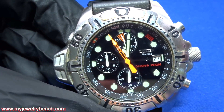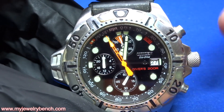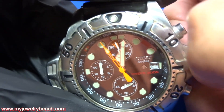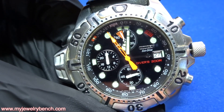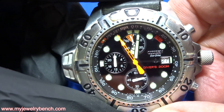I hope that helps. Again, if your Citizen Eco-Drive ever stops working and you pull it out of a drawer because you haven't worn it in a couple of months, just pull the stem out to the second position. Leave it on the kitchen counter for a while and that should charge it up with enough sunlight to charge the capacitor.